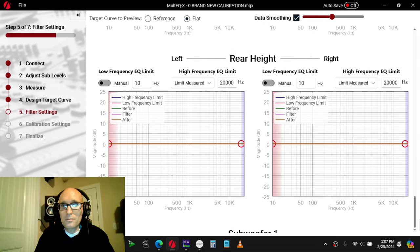Okay, so what I do is use an RTA. And I'm actually not going to use that. I'm going to use 1-to-1 octave smoothing. No, sorry. Yep, it's 1/48 octave, but the actual smoothing is 1-to-1. 1-to-1 is easier to read, and it makes aligning subs to mains incredibly easy. What I like to do with this method, because things are smoothed, is think about how the peak of, say, a subwoofer unsmoothed versus smoothed is different. So whatever level I measure the mains at, I increase the subs by +2 because they're smoothed, right? I found that this gives me what I call reference level bass. And it sounds absolutely perfect like this.